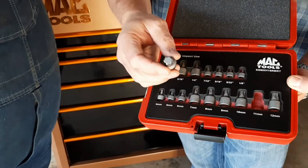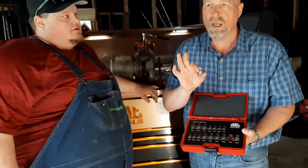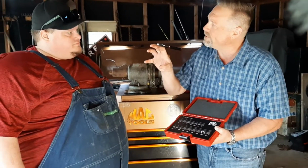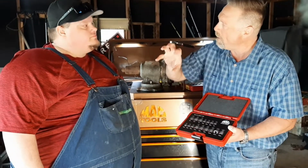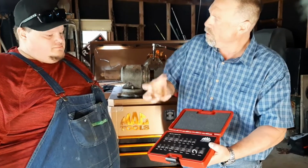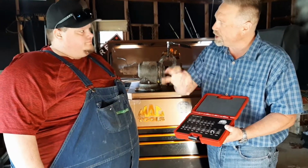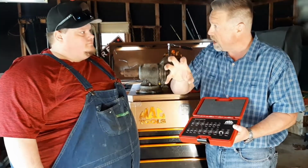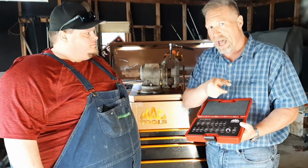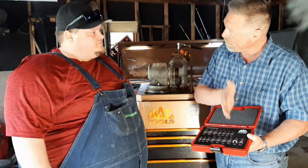with a ratchet. And the reason for that, guys, is we do have impact versions of RBRT, and the heads of the impact version are a little less aggressive. So it makes up for the thump. These are for an incremental increase in torque as you get on the ratchet. The RBRT stuff does the job, but if you put that on an impact, you can chew stuff up with it because it's so aggressive, right? And that thump, the impact ones are designed for that. So there's definitely a spot in the toolbox for both impact and for regular.